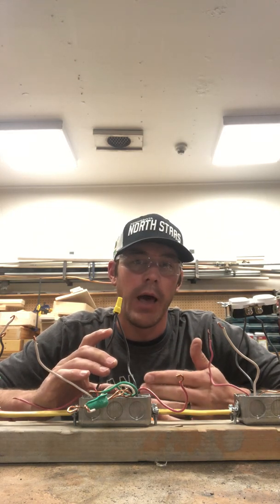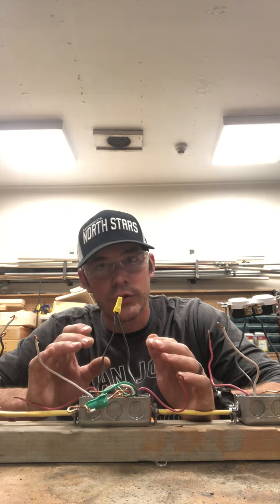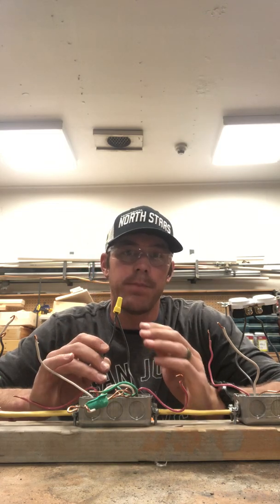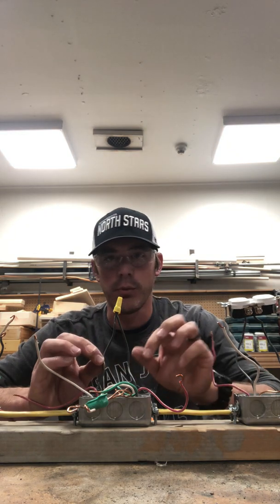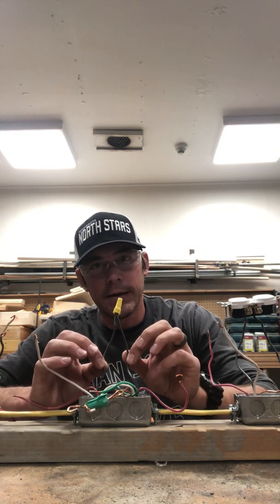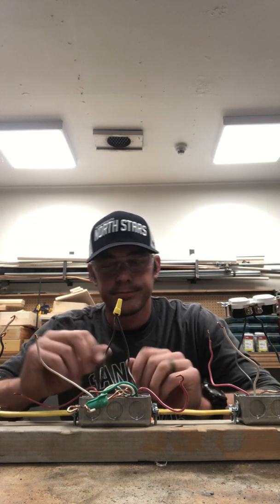You have to be able to have control over that light by the light switch. So the best way of making that approach is by having your power go from box number 1 to your light switch in box number 3, relay it by the two wires, just hook them up by a wire nut.